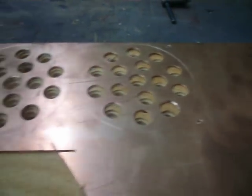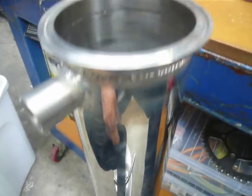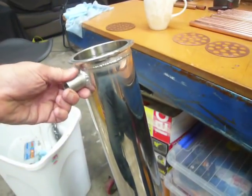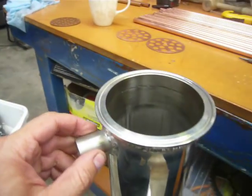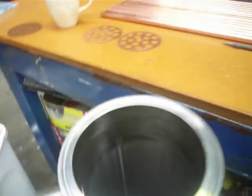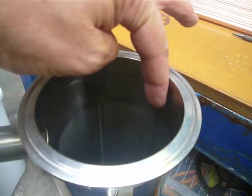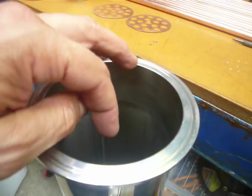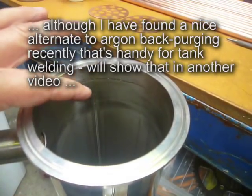I'm back on my 4-inch condenser here. That's the top of it. I've welded the ferrule onto the tube. I've got my socket for my elbow outlet and my inlet down the bottom. What I've done is ground the inside of this — ground anywhere that the weld blew through. I don't purge the inside with argon when I'm welding, so I occasionally get a bit of what's called sugaring come through.